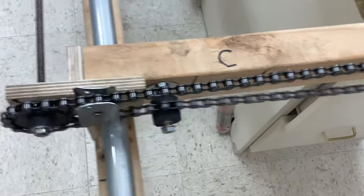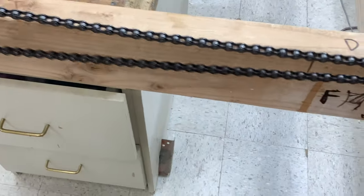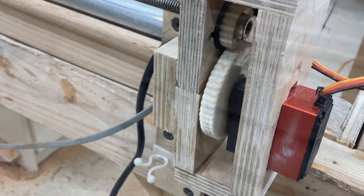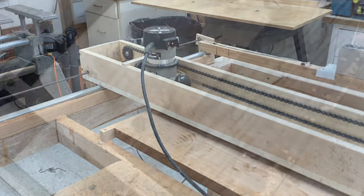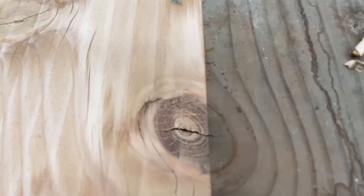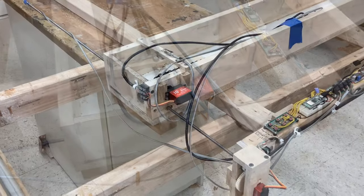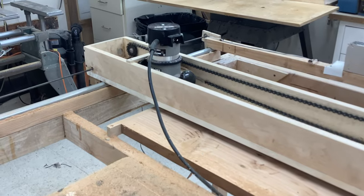However, since the positions of the drive threaded rods were fixed, rollers were needed to control the chain tension and keep it away from the rails. For a new build version, I would move the threaded rods outside the sled box and up by a couple of inches. I also increased the rail speed using the same step-up gears previously used on the router drive — making the rail speed nearly eight inches per minute. I estimate this 2.0 version could do the whole slab surface in two to four hours, depending on the router bit. I tested it on a 2x12 x 36-inch board; the flattened surface was smooth with no burn marks. This is the sled and automation, disconnected from the rails and ready for storage. A pair of additional 2x2s were added to stabilize the original 2x2s and the router sled, and to reduce the stress on the pair of threaded rods that move the sled. I would give this version a grade of B — it's okay for a hobbyist to use.